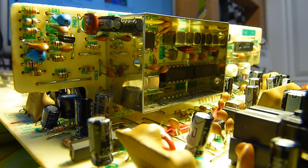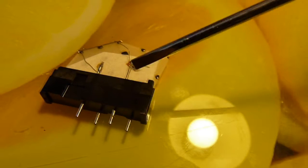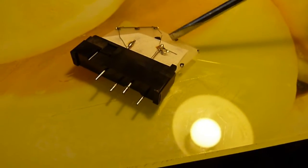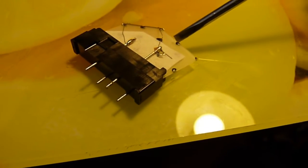We might actually show you inside the delay line because they're quite interesting. I tried doing a bit of removing, but it wasn't too successful. As you can see, I've melted bits of the cover. It's got this strange texture on the external as part of damping to get a clean signal through it, whereas the edges are rather smooth. These are basically little dampers to stop it spraying out and keep it in a straight line like a laser, although how effective that is I don't know. And interestingly, both transducers are on the same corner. Usually you'll find one up here and one down the bottom, but in this case that is not the case.